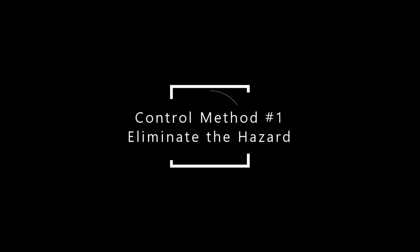Let's talk about the 5 ways to control the dust and to make your shop more comfortable, more enjoyable, and safer. First one, simple. Eliminate it. Just simply find a process and material that eliminates sawdust and the dust cloud altogether. One of these ways is very simply wet sanding whenever you can. If you are sanding a material that has some kind of finish already on it, it's stabilized, or it's been protected, or maybe it's a composite, man-made material, whenever possible, you want to wet sand. Wet sanding knocks the dust right down, and prevents that from happening altogether.